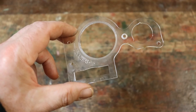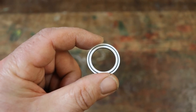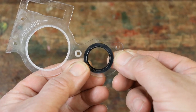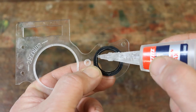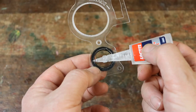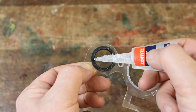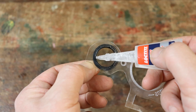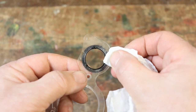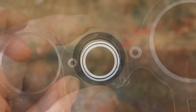Find the seconds engraved panel and the larger of the two black and white rings, the one with an engraved line around it. Working from the back, carefully align the black side of the ring with the lens hole. Once you are happy it is centred, place a drop of super glue into each of the three notches. Capillary action should draw the glue into the joint. Hold it firmly for about 20 seconds whilst the glue sets. Blot off any additional glue with a tissue.